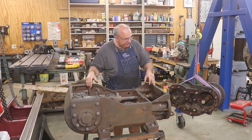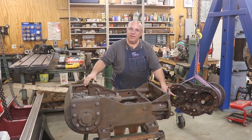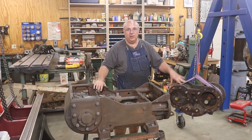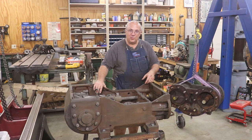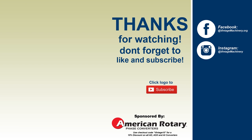What's next? I think I'm going to work on just continuing to disassemble everything. At some point I'm going to have to get these pistons out of the cylinders — they are more or less rusted in place. But we were moving them with just the wedges and stuff, so I feel pretty confident we can probably press those out without too much trouble and hopefully without damaging anything. It's just going to take some time and effort to do it. That's going to be a wrap, guys — as always, thanks for watching. Comments are always appreciated. Please subscribe to the channel if you haven't already, and we'll catch you on the next video.